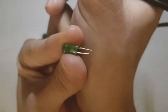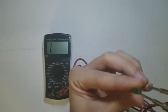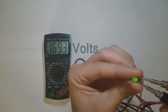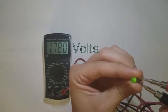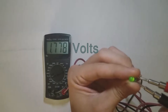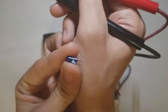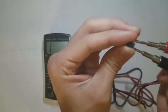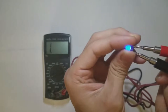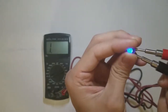Here's a green LED. When we test this LED, the continuity test tells us that it takes about 1.78 volts to turn this LED on. Here's a blue LED. Notice that the LED check can turn on the LED, but the voltage is too large to register on my meter.